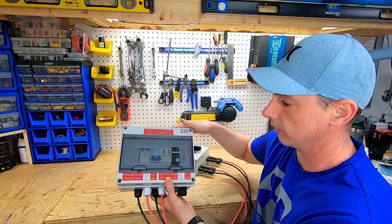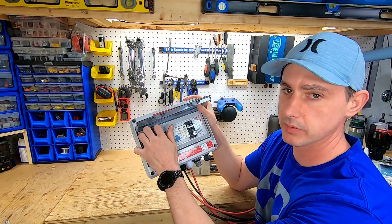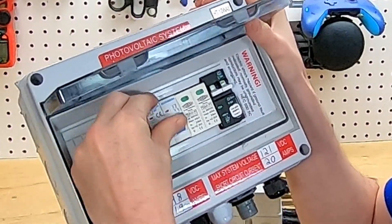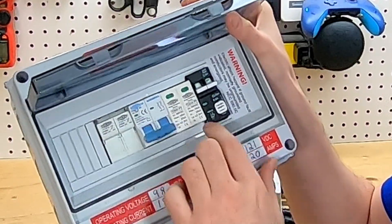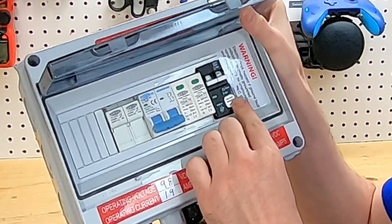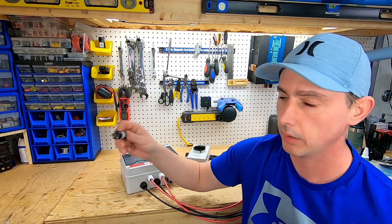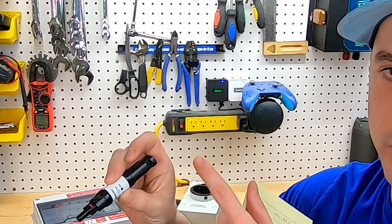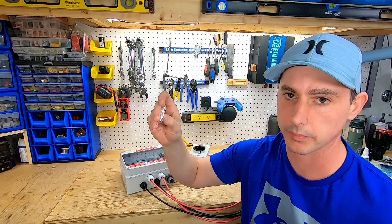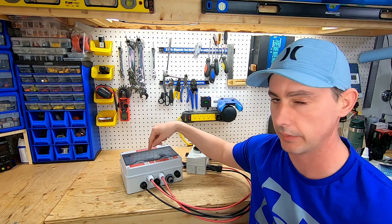In this box I have all my markings for my voltage and current. I have all my switches in here — fuses for overcurrent protection, a breaker for when my series strings get paralleled together, lightning and surge protection, and also GFCI protection on my solar array. If you have a smaller system you can get away with running an inline fuse style, which just screws open and inside you'll have a fuse. Typically you'll run about a 15 amp fuse on most solar arrays. I have two 15 amp fuses inside my box and then a 25 amp breaker.